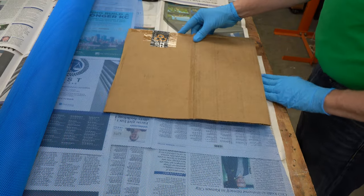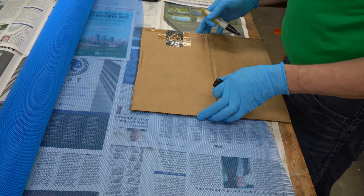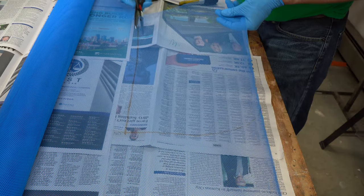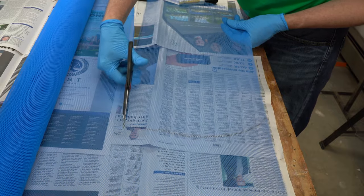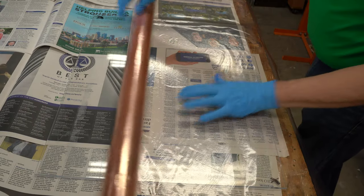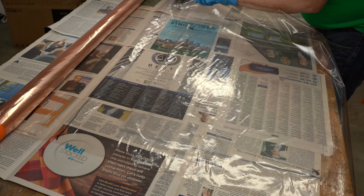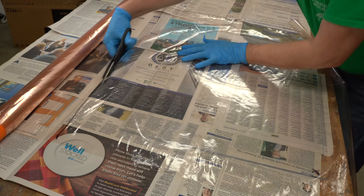When you cut the flow media, you want to cut it to roughly the same size as your carbon fiber. You don't want to cut it much smaller or you're going to have a hard time getting your epoxy to flow. This new vacuum bag is a replacement for the old blue vacuum bagging I had been using, which always felt fragile and about ready to tear. This is thicker, tougher, and just a little bit stretchy. So far, I like it.